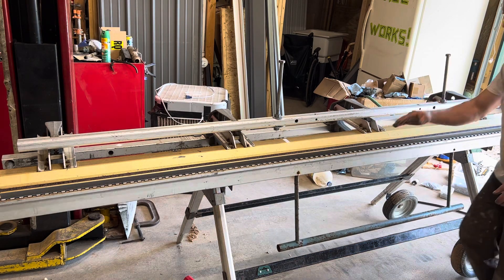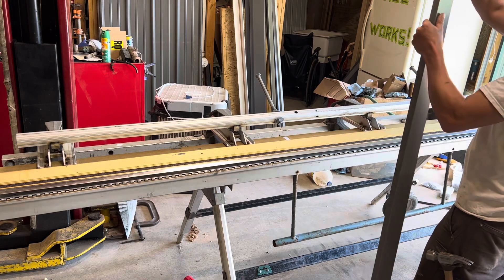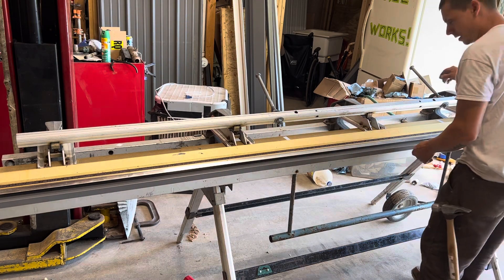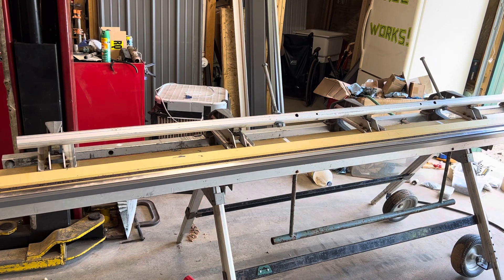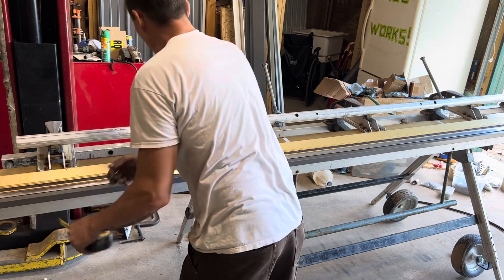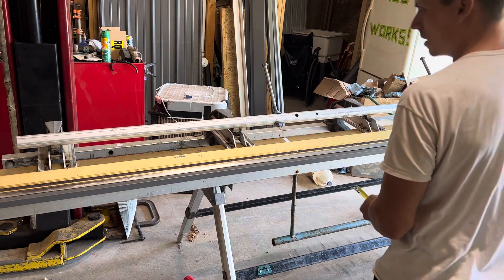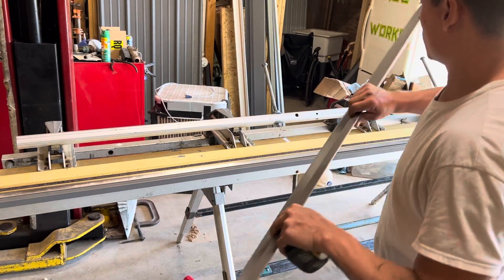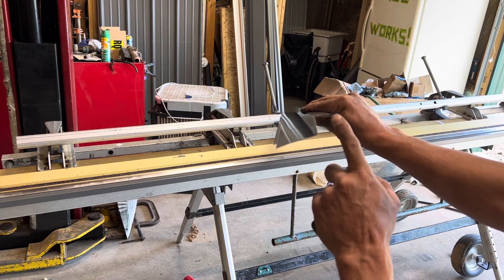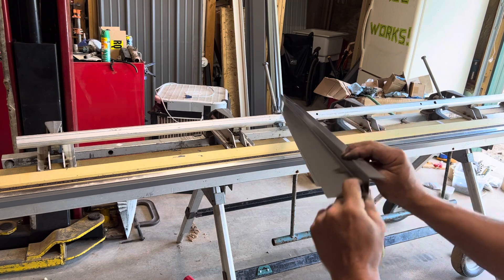This brake is so old that it does a little belly right here in the middle, but I can adjust these and get that out. I want it to be kind of loose because I'm doing this gauge steel — it's like 16 gauge or maybe 18 gauge. I'm doing seven-eighths on that rib over here that sticks out three-quarters of an inch, so I'm doing seven-eighths. This is roughly an eighth inch right here, and you can see how it's not all 45 — really it's a little more. That way when I press it up it's going to hold tight.